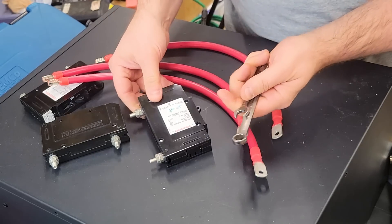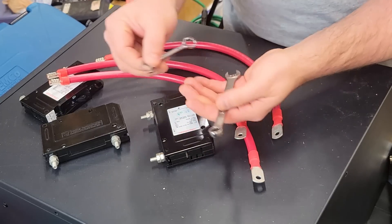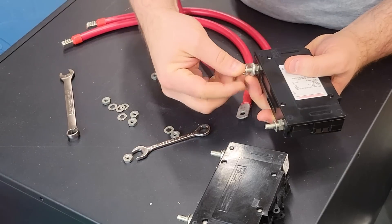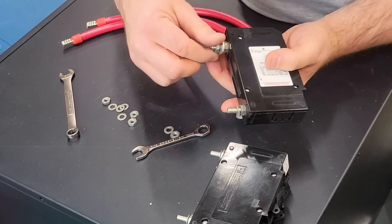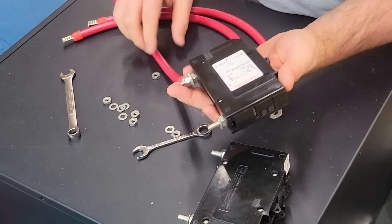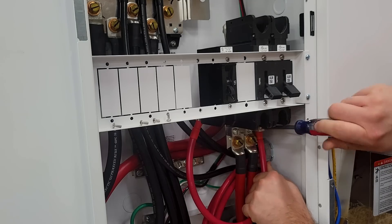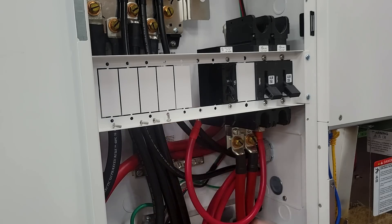The nuts on this quarter-inch stud are 7/16ths, so you're going to need a pair of 7/16ths wrenches, and one of them has to be extra thin. We're always flowing power from the solar array to the load. I take one of my pre-made wires, put it on the stud with the nut and washer, keeping it just finger-tight for now so there's still some movement. I'm getting everything prepped loose because I don't want to stress the cable too much. Then the grub screw gets torqued down, and we tighten the nut on the back side.